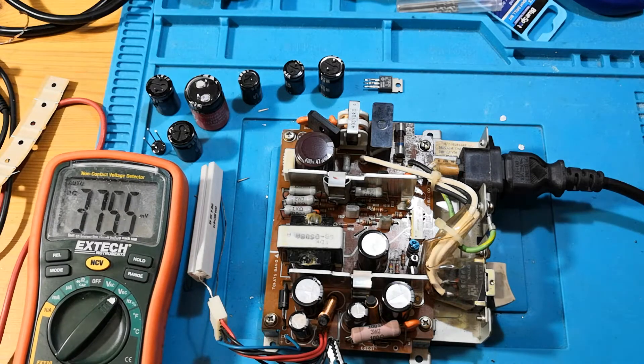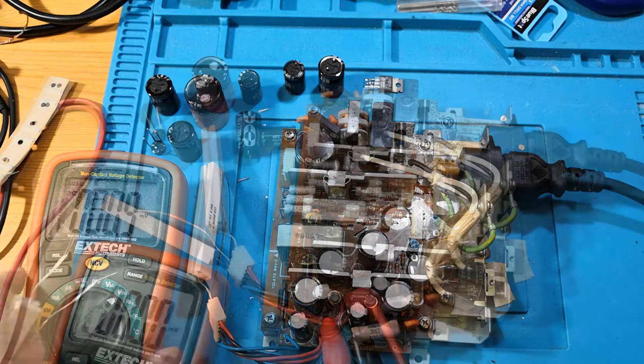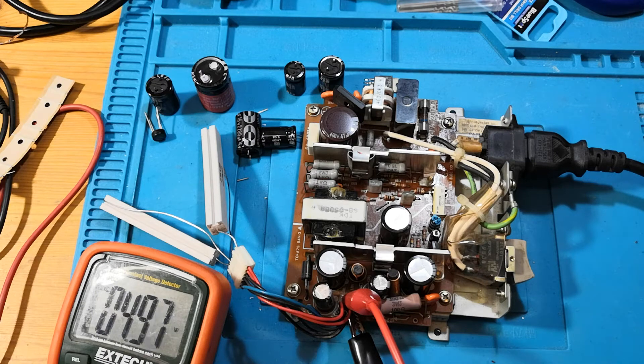So now let's try 5 volts. I'm going to have to turn it off to do this. That's good enough for me — 5.02. Before, with a load resistor on, that was getting loaded down. So in fact, let's load it with both resistors and see what happens. So here we are — we now have both load resistors. According to what I'm reading, this should put 2.2 amps on the 5 volt rail and 1.2 amps on the 12 volt rail. Last time when I tried this, the 5 volt rail dropped quite a bit and the 12 volt rail was at 10 volts. So let's see what happens now. 4.97 — that's fine.